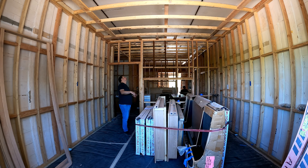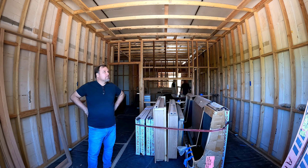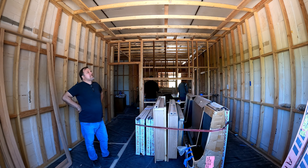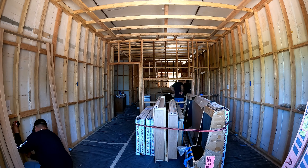There are a lot of compromises we have to do. On the other side of this is a garage, so we're not really worried about the sound going too far into there. This thing's going to be pretty soundproof even though we're compromising a little bit. We'll have a little bit of airspace and we'll have the mineral fiber in here. Besides the garage wall, all the other walls are cinder block — not fully filled with concrete cinder block, but they are cinder block — so we do have some mass that's helping us isolate the bass.